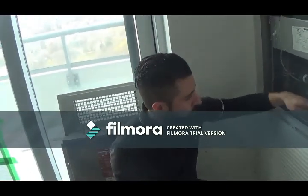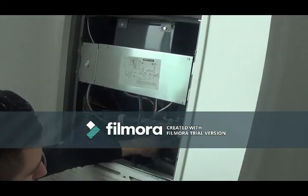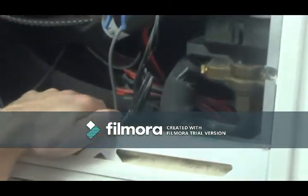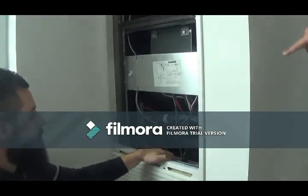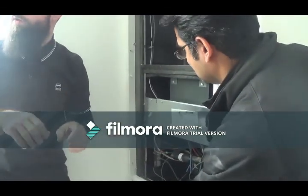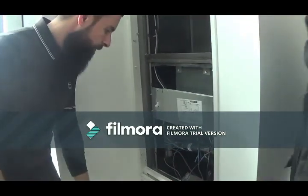One year. Yeah, so your actuator here is basically going to press down. You're going to see this stem press down, and then you know that you've got water flowing through the coil. On or off valve, and it's all controlled by the thermostat. Correct. The thermostat turns it on, heat there, everything goes through the coil, and the blower goes through the cycle. Okay, so there is nothing much here, just to know that there is that actuator, and your isolating valves if you ever need to turn the water off and remove the unit. And the filter is at the bottom there.